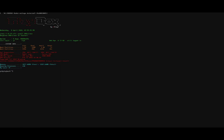Since USB direct boot is not supported yet by the current firmware on the Pi 4, I'm going to keep using this method — SD card plus USB device. I'm going to provide you all the files I have on this SD card. You can format your SD card as FAT32 and just copy-paste these files into it and you're set to go. You can use it for other boots and configurations as well.